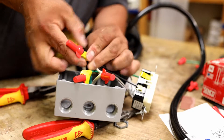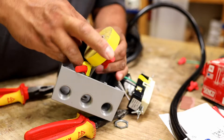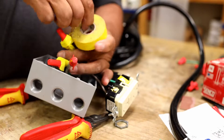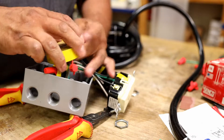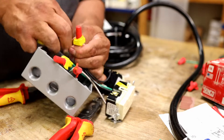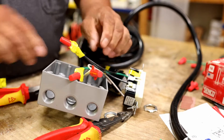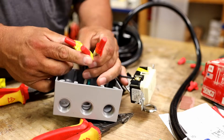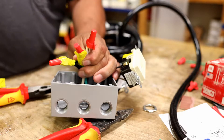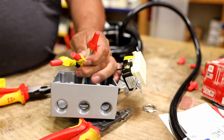I learned this step up north — they don't do it much here in Virginia: grab the wire nut and tape it tight, and tape the wires together so they don't come loose. I still need to do the neutrals. That's the last step I'll take. You don't see this step very much, but I think I've seen it on high-voltage machinery.